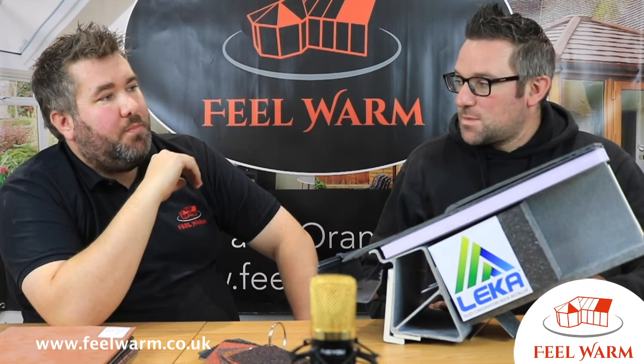This is like a third generation system, right? Absolutely. So you have the initial systems, which were your polycarbon, your glass, and everything else, and the initial warm roof systems, which were aluminium but didn't need to take a lot of insulation because building regs back then didn't require it. Then you had your second generations, which were based on the first, but redesigned to be able to take more insulation, be easier to fit, quicker to fit. But they still use timber boards, timber fillings here and there to achieve what they need to achieve. And then along came the Leka, a third.